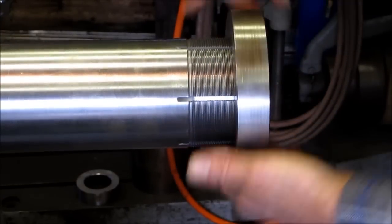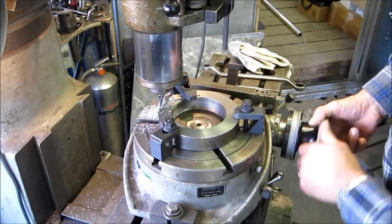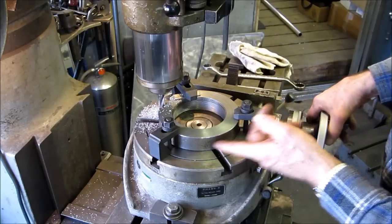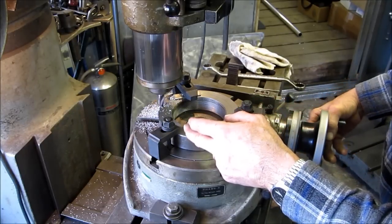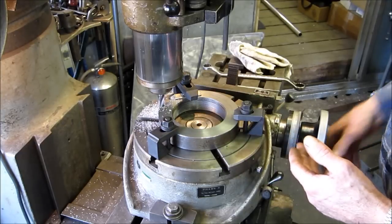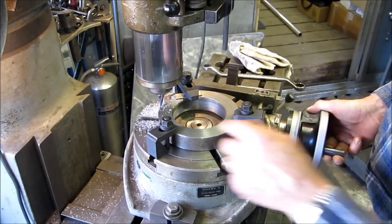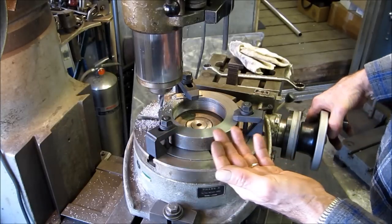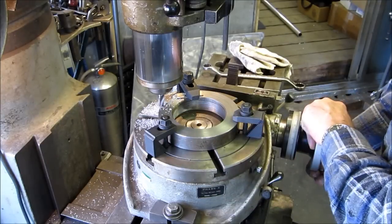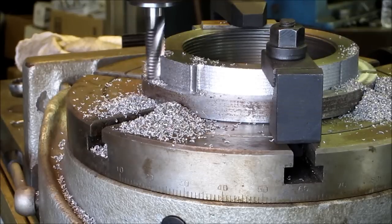Let's go make some shape on the nut there. I've thrown the rotary table up here on the Bridgeport mill and I'm using a turbo end mill. I laid this ring on and it lines right up — eyeballed it right to a line on the table. I was almost going to torch cut this outside off but I didn't want the heat; I didn't know how much distortion it would cause on the threads. So it's going to be a little more work — a couple passes around, moving these clamps, flipping the part over and coming in on the other side. I'll just whittle at it; this is how I'm going to get rid of all that material except for that ear where the bolt's going to go through.